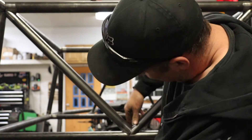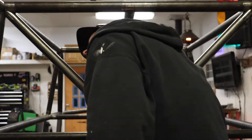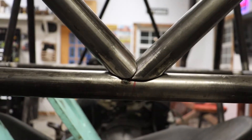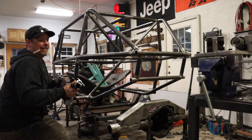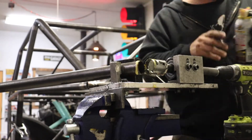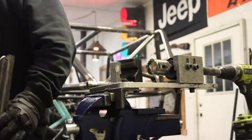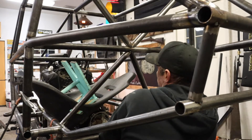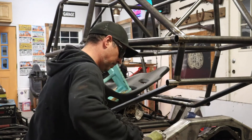These two fit together just right at the center of the chassis — that's kind of what I was aiming for. This lines up right with the center of the chassis and is all really nice and tight, so happy with how that came out. The X-brace behind the driver's seat ties the top of the buggy down to the bottom in a cross pattern. This makes the chassis more rigid and safe in the event of a rollover.